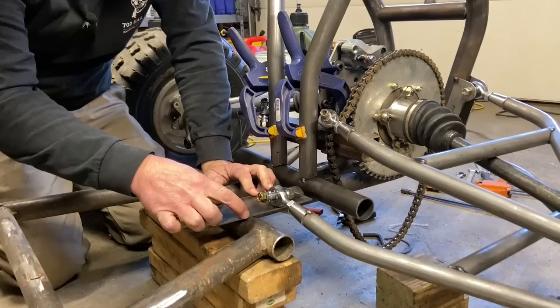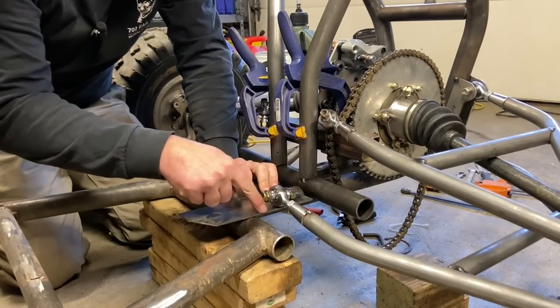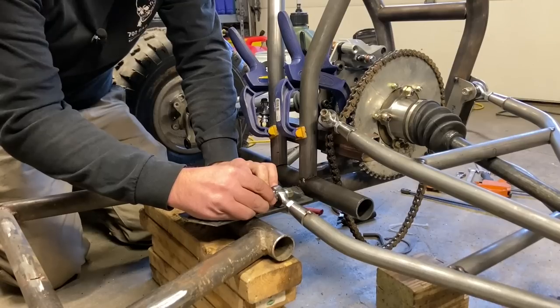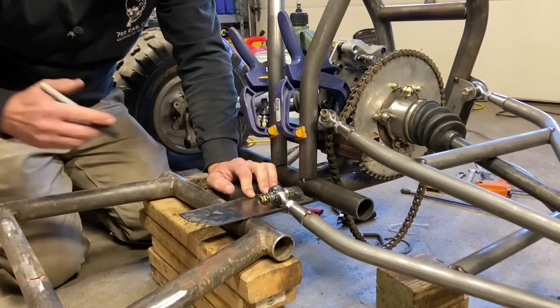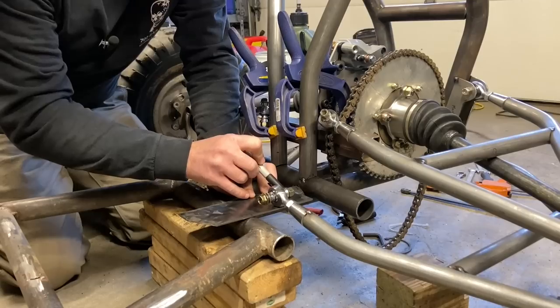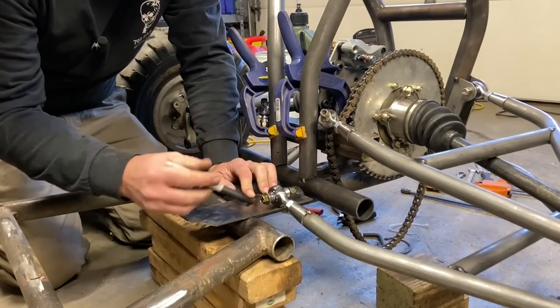and this is 3-inch, 1/8-inch plate, and I will make a bracket that just welds to here. It's worked out really well. I haven't had any problems with it. But instead of having a square, crazy looking piece, I will mark a boundary for my bracket, and then I'll cut it to a cool shape.